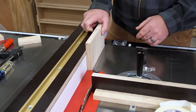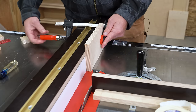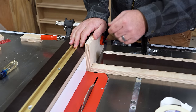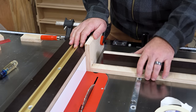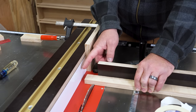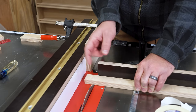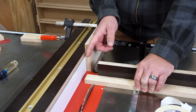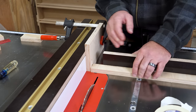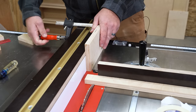What you'll see some people do is take a piece of plywood and fasten it to their fence as an auxiliary fence, so you register off of that instead of the regular fence. Now when you go to cut, you have a little relief in there. But it's not really enough space, and depending on how long the pieces are, they can turn and twist, and as soon as one catches the blade it's coming back at you. The other problem is you're no longer at two inches, so now you're stuck measuring, marking, and testing with the tap-back-and-forth routine — not one I particularly care for.